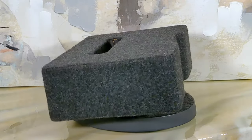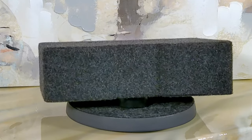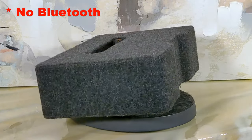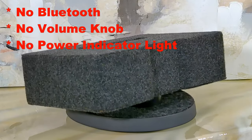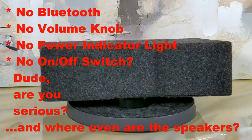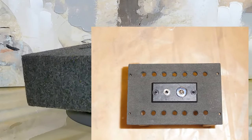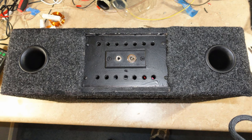In designing this, I wanted stealthy simplicity — a smallish full-range stereo system that I could plug into my laptop computer, which I bring along on pretty much every trip we take. That means there's no Bluetooth, no volume knob, no power indicator light. Heck, this thing doesn't even have an on-off switch. I'd use the computer to control the volume, so all this portable stereo needed was a DC jack to get the electricity to the amp board and a 3.5mm audio jack to bring in the audio signal. That's it. Simple.